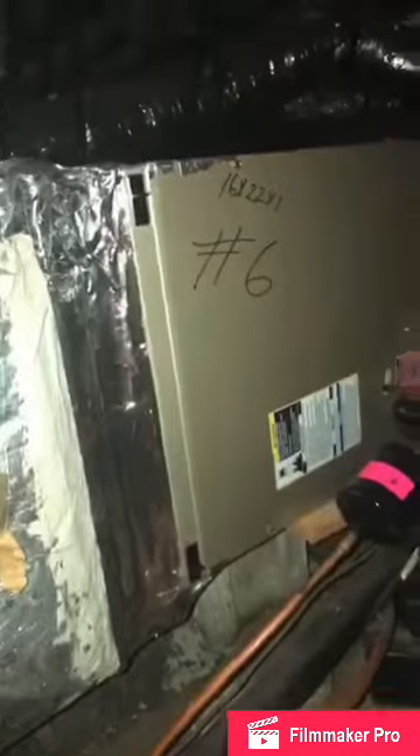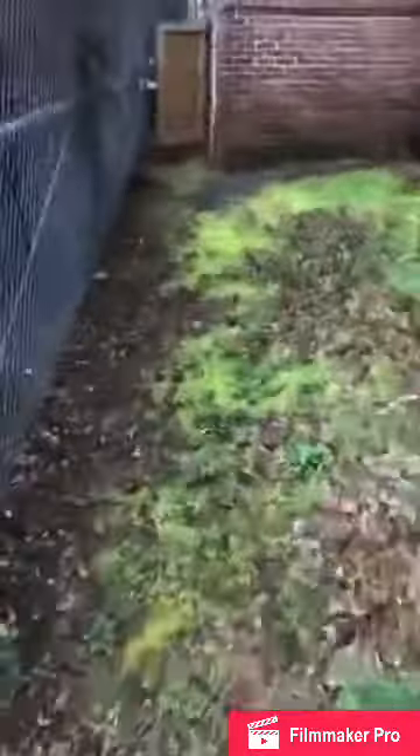I gotta go grab that filter and then we'll maintain this beautiful carrier heat pump. The funniest part is that to get the filters there's another crawl space. Rule two: you should probably always make sure that the filter size written on the unit is the actual filter size. Let's double check — it says 16x22x1.